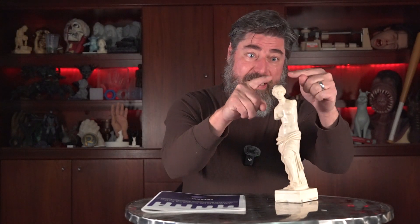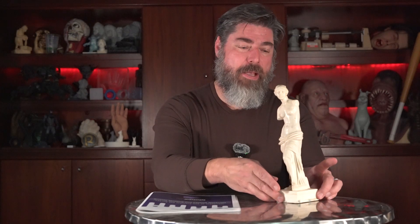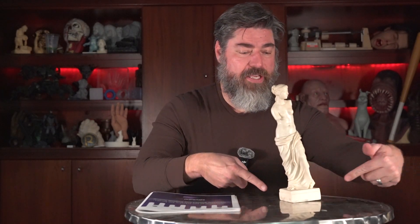That gives me the ability to control the thickness the way I do with a brush-on mold — around the neck and the head — so I have a nice uniform thickness, undercuts filled, and my flange accounted for. Once I get that all sculpted the way I want it, I build my mother mold around it.